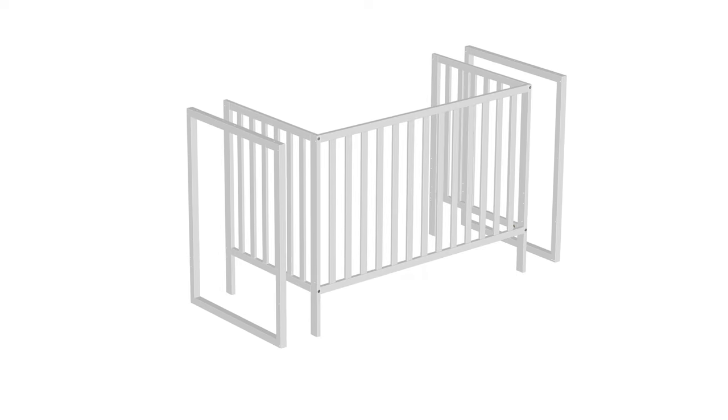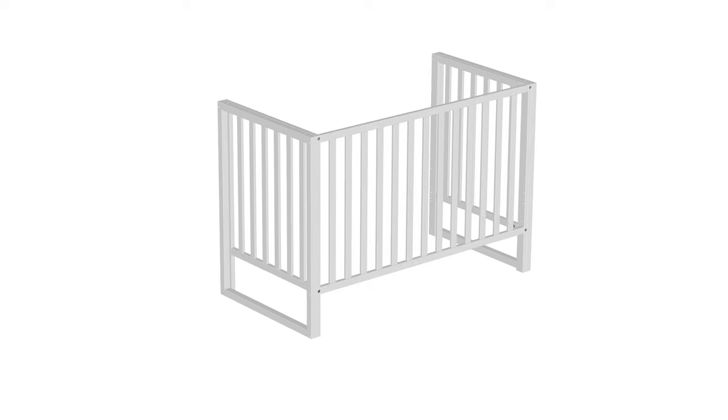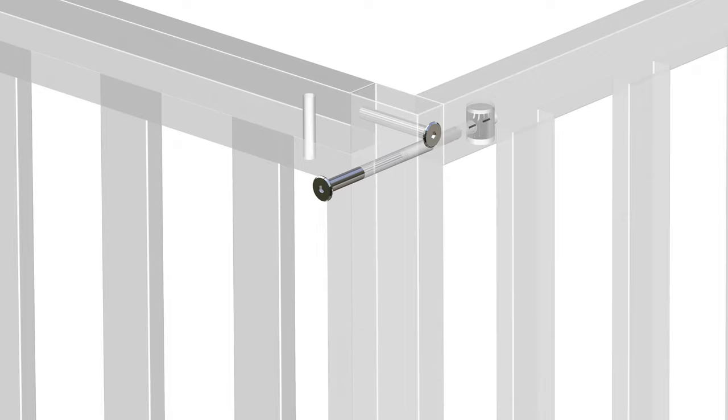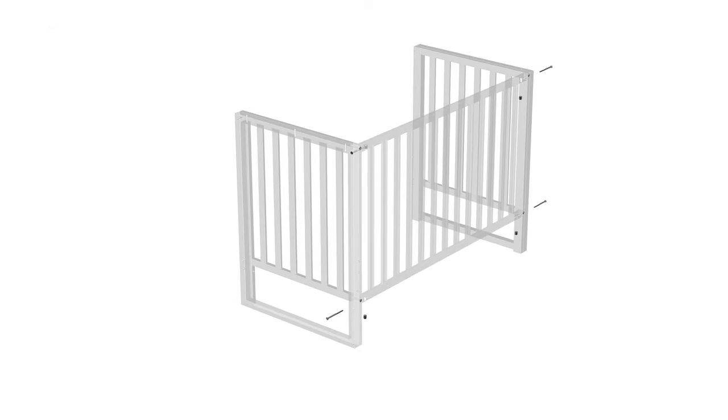Next, place the bottom left side, part number 11, and the bottom right side, part number 13, at each end, matching the holes of each back post. Push the parts towards the assembly and attach using four part A bolts and four part J barrel nuts. Starting with the top corner, insert the barrel nut through the bottom of the back rail and the bolt through the back post into the barrel nut. Tighten the bolt using the provided part H Allen key. Continue by tightening the bottom bolt.